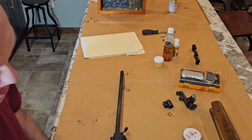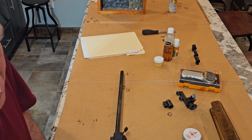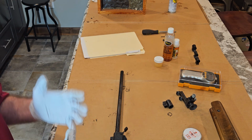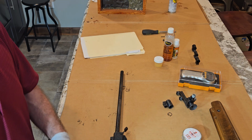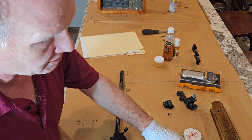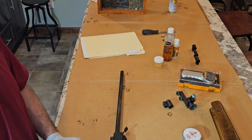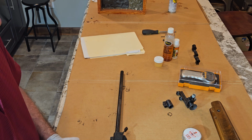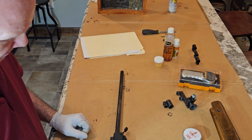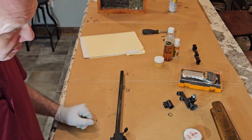It should keep the leather supple. Every 250 to 500 pellets, I'd say maybe 2 drops of something to keep the leather supple. Otherwise, that way the leather seals can really last decades. They can really go for a long time, kept somewhat moist, so that leather doesn't dry out and crack. It's able to keep a perfect seal in the cylinder. It polishes the walls. It's just a very good system.